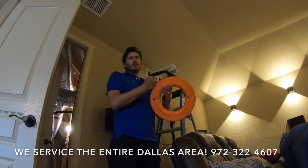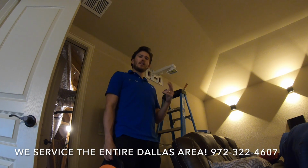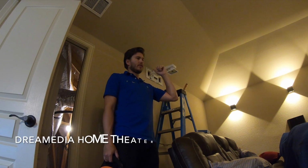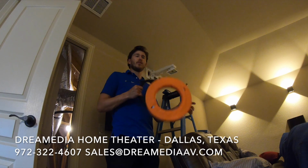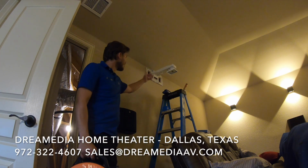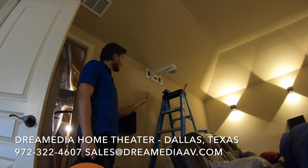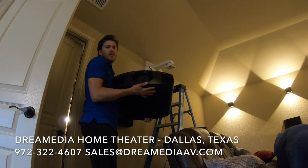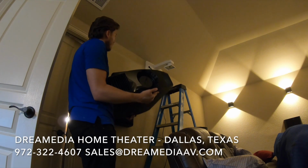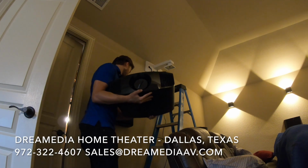Okay, guys, so I just fished HDMI and Cat 6 from the projector to the front of the room using fish tape. There's a Smurf tube that's currently there. Now I'm just going to relocate power and pull those HDMIs through the wall to this side and get everything capped off. Just going to take me a minute. All right, guys, you can see now I have my power as well as my data and HDMI in, and I'm going to mount the projector.